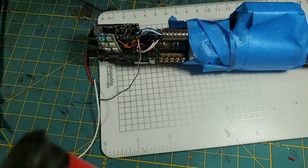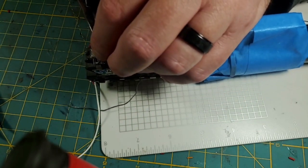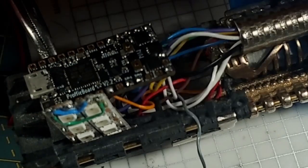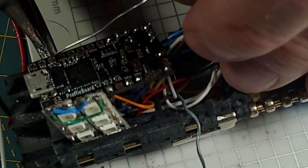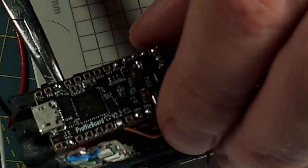And this is 26 gauge because I use 26 gauge for my main Neopixel data. And I'm going to twist. And I'm going to tin this sucker. Just like that. And I'm going to grab it, and I'm going to send it up through that third hole, which is pre-resisted. And I'm going to try and cut some of that wire off because I have too much strip there. Again, we're right here. Bada bang, there's our main Neopixel data soldered on.